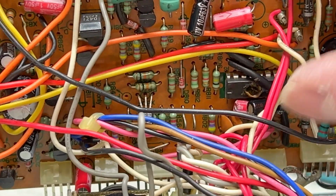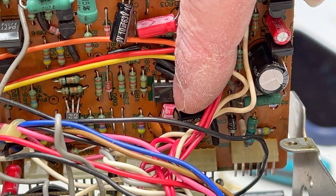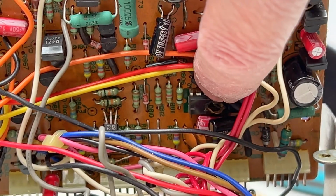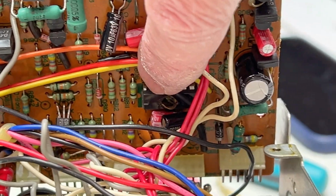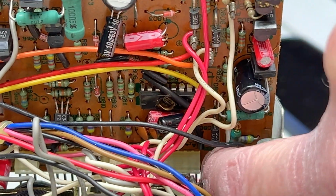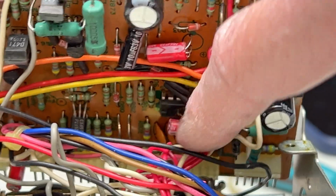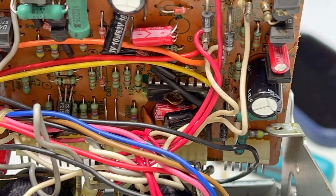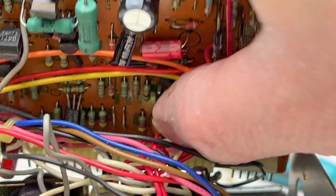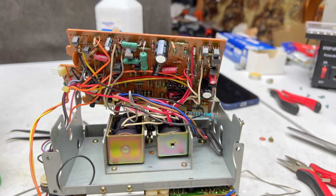But that one capacitor there, that black one that's on top now, that one will give you a hissy fit, because it solders down to one pin up on top of the chip, and then the other one is way down there by the connectors. So that's going to be a problem. And then there's this 0.47 beneath it that's really going to make you curse. So just go very slowly and you'll get it done, I'm sure. Anyhow, that's it for that.